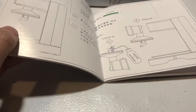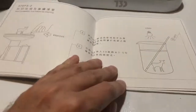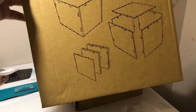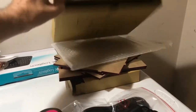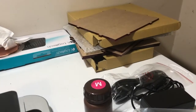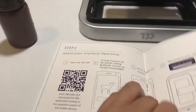So you wash it all with water and detergent. You wash the 3D printed object or put it in water for about 30 minutes or so. Then there's an enclosure where you take the object and put it in the box — the plastic is red — and this is for direct sunlight to cure your 3D printed object after you're done.